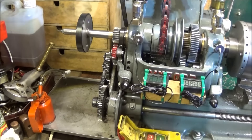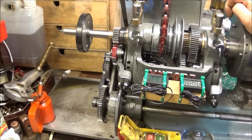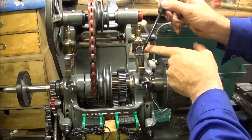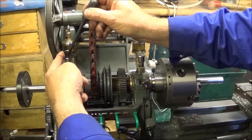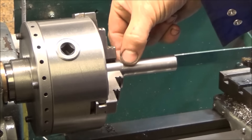I think the tachometer is such a good idea and a good indicator for the spindle that I'll get a small one I can permanently leave on the lathe — I've seen battery-powered ones on eBay with a magnetic mount that look ideal for the ML7. Also, to keep everything running smoothly, I put a shot of moly slip in the front oil cups at the beginning of every machining session.